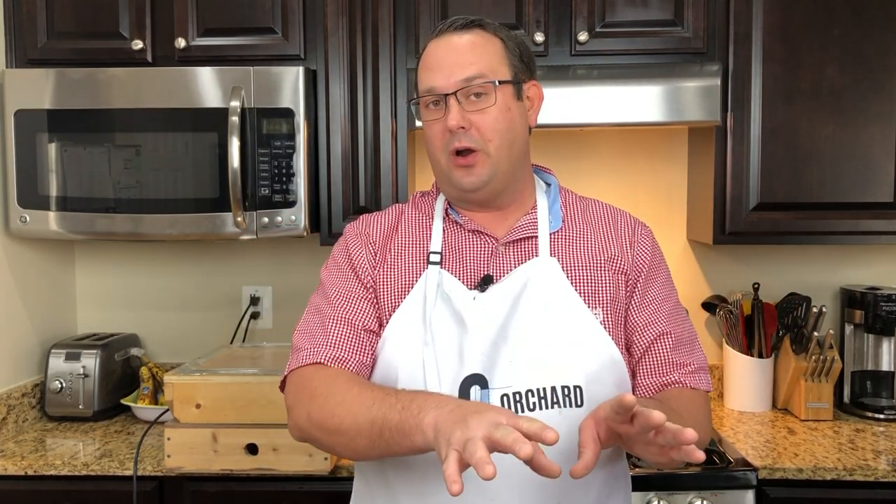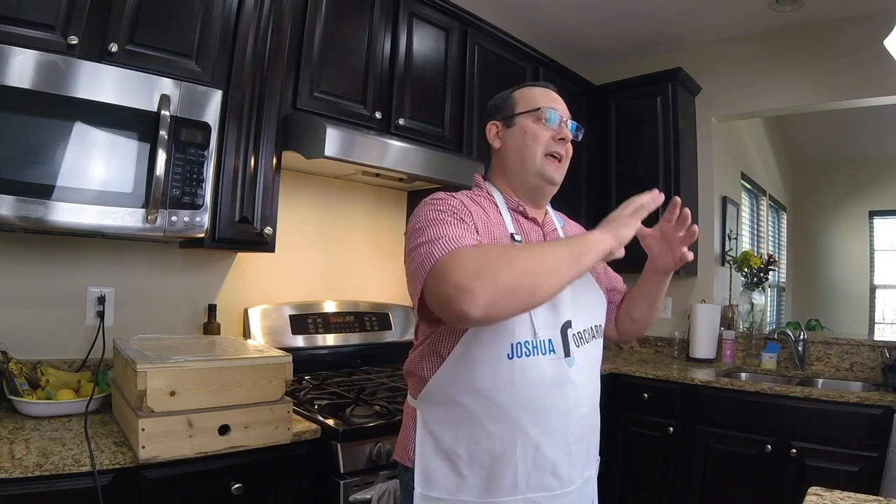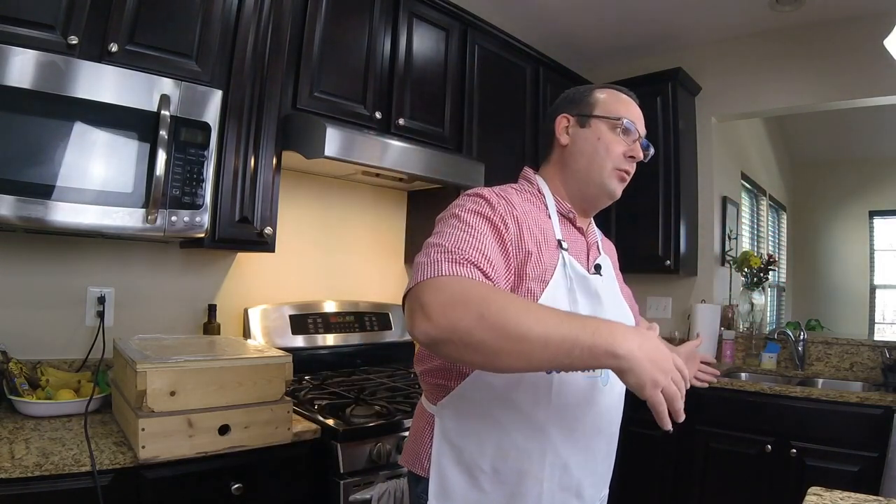So when you go to vacuum form the part, you have to have a clear vision of how you're going to do this before you even put the plastic in the oven. You need to position the part roughly in the middle of where the plastic is going to be, so that the plastic pulls as evenly from all of the edges. I'm pulling a round part using a square sheet, so the way the plastic is going to pull is not going to be completely even. By centering it as much as possible, it's going to pull as evenly as you can manage. You can make a larger piece of plastic but you end up with more waste. You can also have multiple parts within a pull.